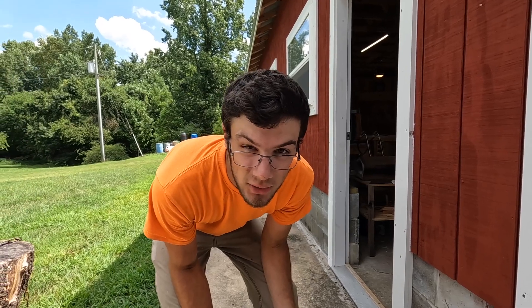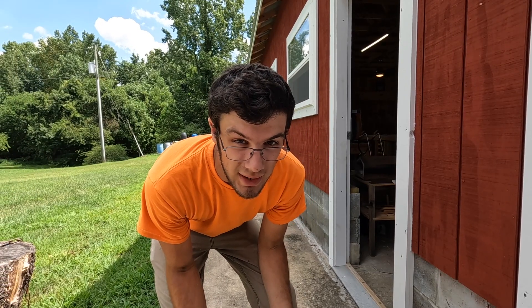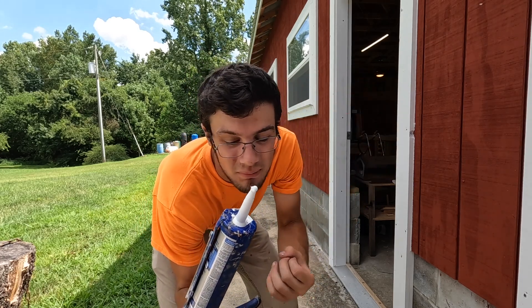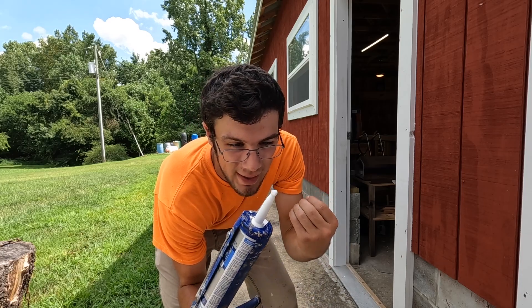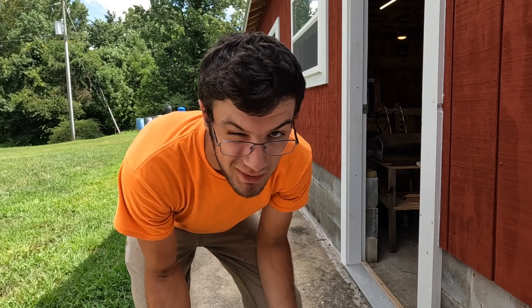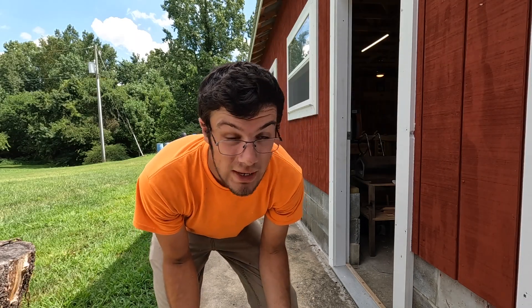So anyway, there you go — that's how to caulk windows and doors. The top is exactly the same as the windows so I don't think I'm going to show you that again. Go all the way around the edges on the inside to pull out a plug when you're caulking — makes it a lot easier. Click as soon as you're done, loosen up the tension so you don't get caulk everywhere and make a mess. Those are the important things. And make sure you get in those grooves on T111 if you're doing T111.